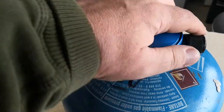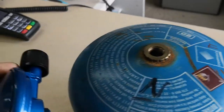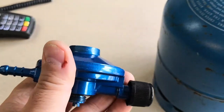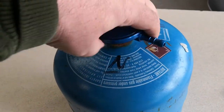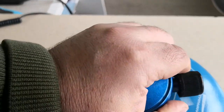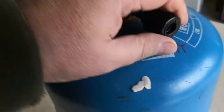But if the hose did ever pull off, here's something really important: each season at the beginning, give your regulator a shake. I don't know if you can hear it rattling, but that rattle is a little ball bearing. If it doesn't rattle, it means your regulator has rusted up on the inside.